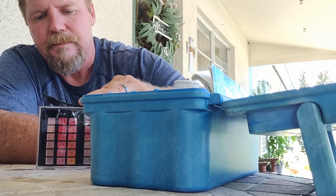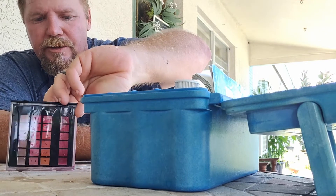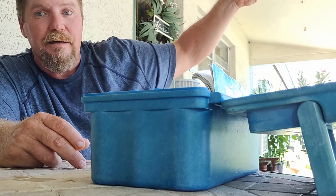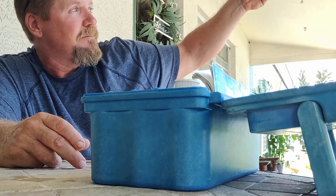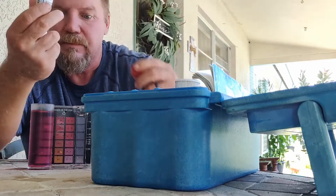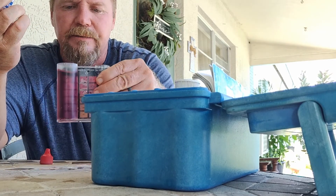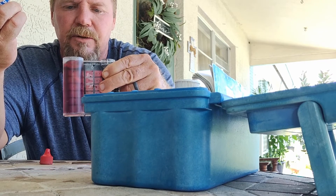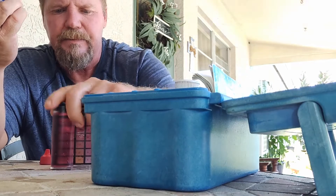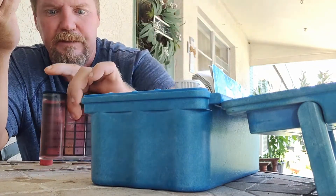Put the cover on and shake it. The best way to read it is to hold it up and look at the northern sky, preferably against blue sky — that's how you get the best reading. You can see we're at about 8.0 on our pH. The next step tells you how much acid to put in by drops, so we're going to put one drop in, give it a shake. Two drops — give it a shake. That gets us a perfect 7.4.